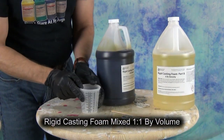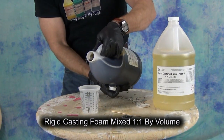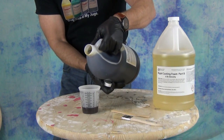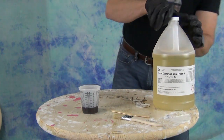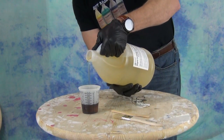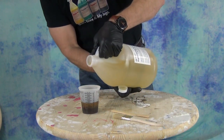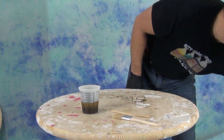This is our six-pound rigid casting foam — a general purpose hard casting foam that cures to a six-pound density, which is actually a medium density for rigid foam. This particular foam is going to expand around nine to ten times the original volume. For the first part, some of this is going to be guesswork. There's no easy way, if you've never cast into that mold before, to figure out the exact volume without really complicated geometry. You just need to mix up a small batch and see where it fills the mold.